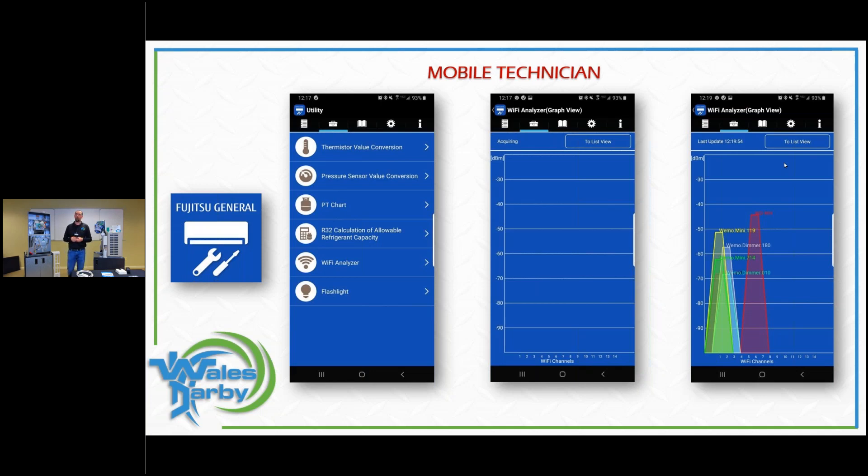On the left side of the screen you can see a lot of different signals mixed on one channel — if your Fujitsu Wi-Fi is on that channel, there could be connectivity issues, maybe working for a couple weeks then dropping off. But that red triangle by itself on its own channel — you're probably not going to have many issues there. Take that phone with the app, put it next to the Fujitsu head unit, and look for the homeowner's network name.